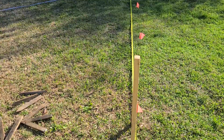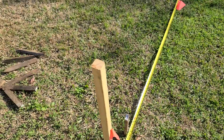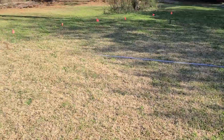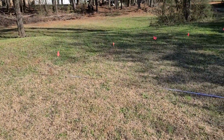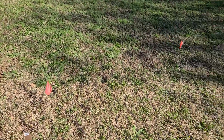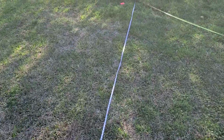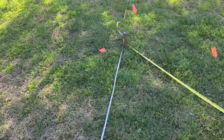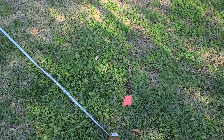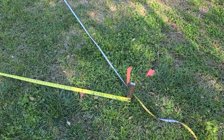That's what I purchased. So we had to measure out here 20 feet this way and 20 feet over here. And then to make sure it's squared, we had to measure across here 28.3. And what they do is they give you the measurements on the paper that they give you, so you have to kind of keep going over it. And what you want to do is set up and measure from the outside line. So that's why I left everything here.